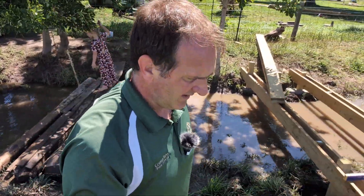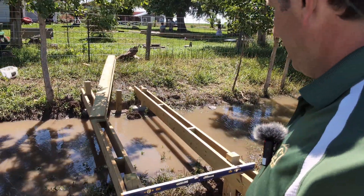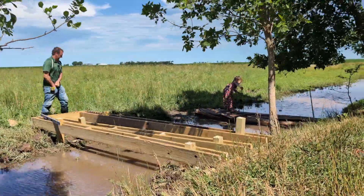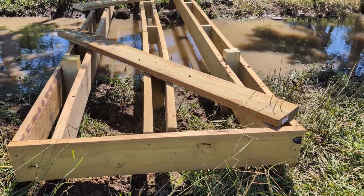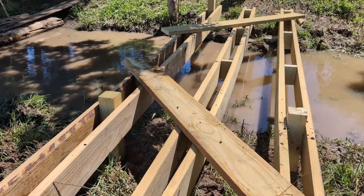The sun's getting higher and my — wait a minute, that's not a dock, that's a bridge. My bridge is improving slowly but I've still got a lot to do. I'm just about ready to put the middle section of beams in. I want this thing to be strong — maybe we'll do a time lapse so you can see just how long it takes me and how many times I go back and forth. We now have all the posts in, all the beams hooked onto the posts, and I've got it leveled up. Now because I'm using such terrible cheap lumber I'm dealing with some issues, so it's going to take a little bit of straightening and planing to take some of those high spots off.